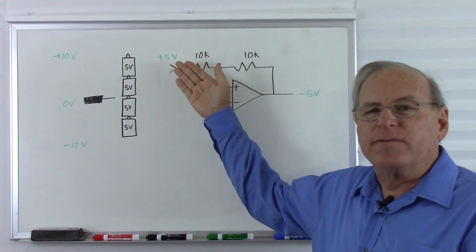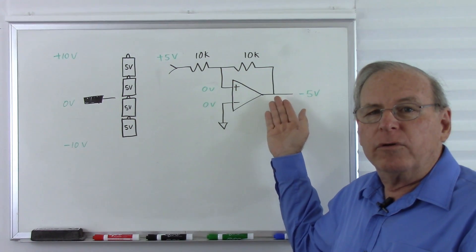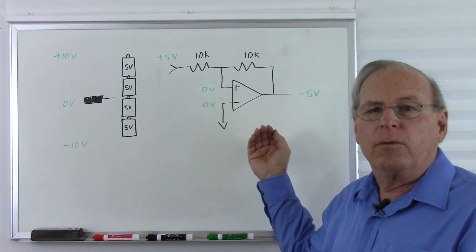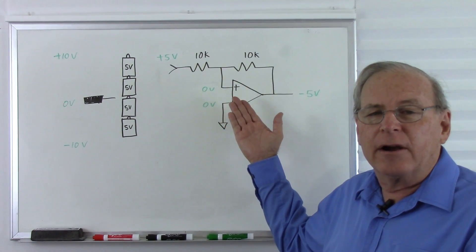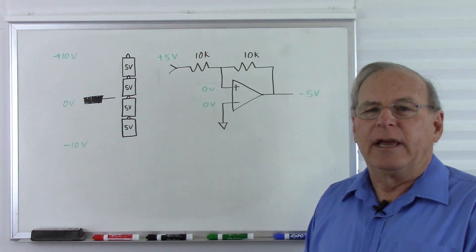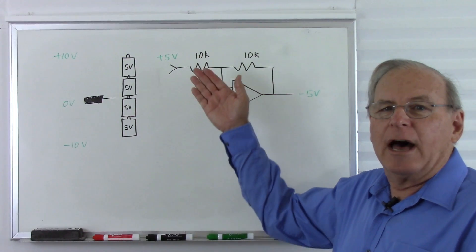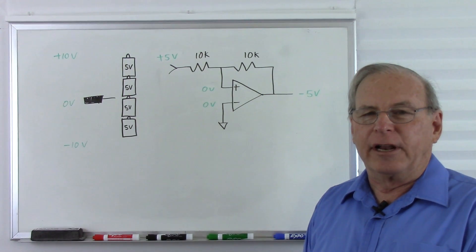We have positive 5 volts here and negative 5 volts here. The op-amp is doing what op-amps always do — adjusting its output voltage to whatever it takes within the parameters available to make the two input voltages equal. Those two voltages happen to be zero volts, but that's not because there's nothing there; it's simply the same voltage where the black lead happens to be. So thanks for watching, and thanks for your video, Dave. It's one of the better videos I've seen on operational amplifiers on the internet, but even you said people get confused about the voltages seeming to disappear when they get to the op-amp. Hopefully this cleared it up for some people.